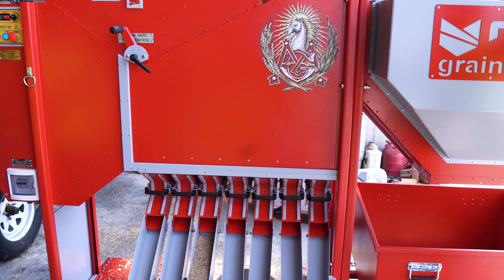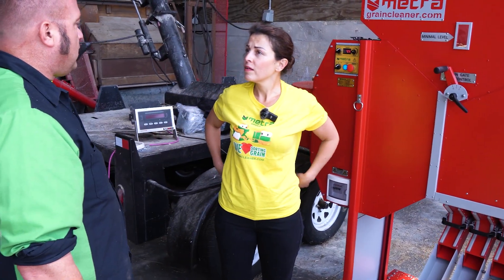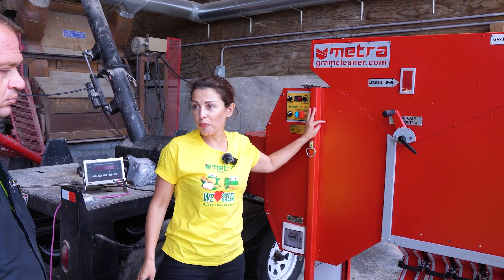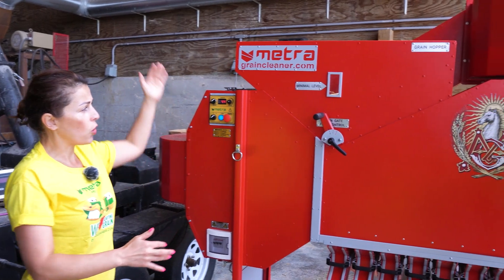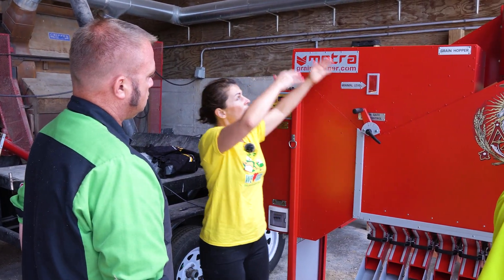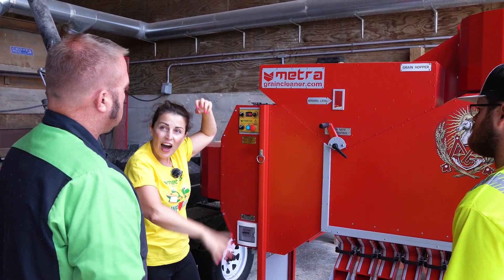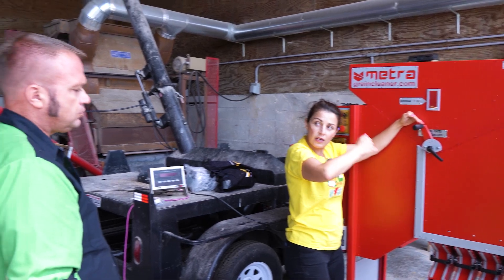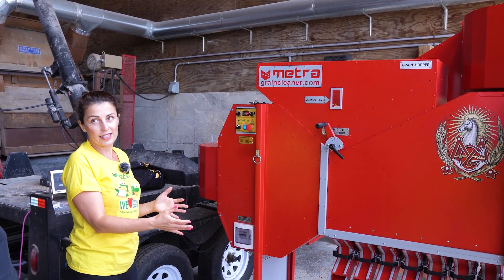So you can fine tune it the way you like it. But the first shot — you like it? Yeah, very impressed with just how little we've done with it. I'd have to run that quite a while to get it where I'd want it with the old machine, and it wasn't as simple as this. The machine is truly quickly set and can give you already good results. Once you get your hands on it and set it up for constant feed with minimal hopper level, you'll get better results. Because if your hopper is empty and grain falls from higher up, it falls stronger and faster. You want it to fall on grain — you want your hopper to feed the cleaning chamber gradually.